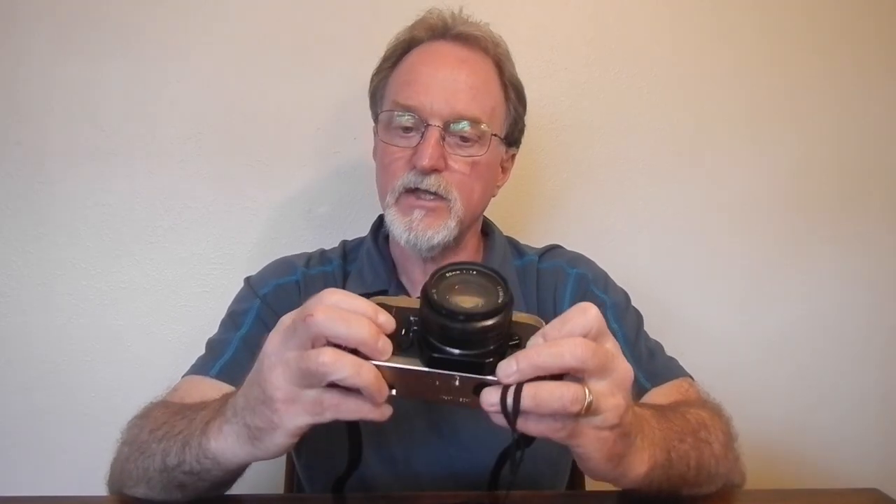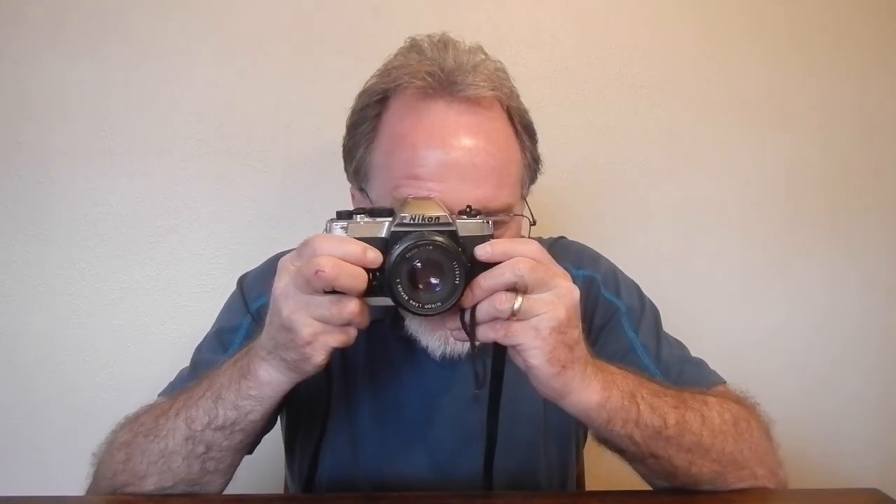The 'Super' in the Cosina version means it has a self-timer, and this does have it — a 10-second self-timer. The features Cosina did for Nikon that not all CT1 Super-based bodies have include a depth of field preview button, which is nice if you need to check focus or if you're using macro extension. Multiple exposure is also available; it's nice that it does it, though it's a little bit of a pain to use. You take your first shot, then you hold this little lever back as you wind, and that cocks the shutter without actually moving the film.